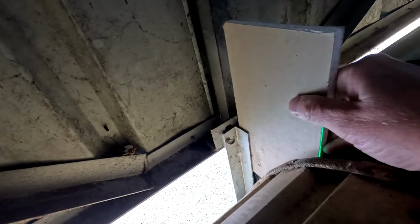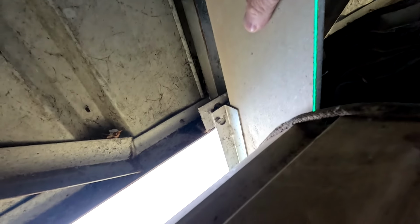This one here is a bit of a tricky situation. I think we have to go somewhere inside. You can see the green line. This would actually match. So somewhere like this. And up here with this angle support for the roller doors, I have to make some timber or something where I can screw the plasterboard against. It is really a tricky situation here. And I've got enough space to the roller door on this side, and on the other side I will be probably like this. So there is a bit of space as well, which allows for the movement of the roller door.